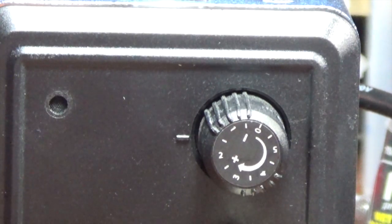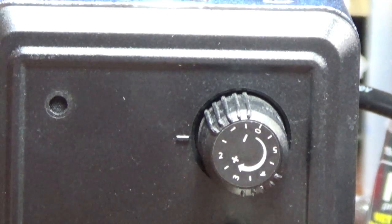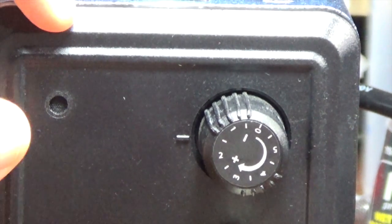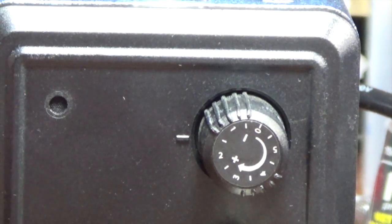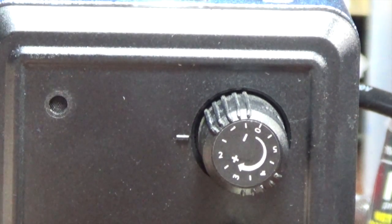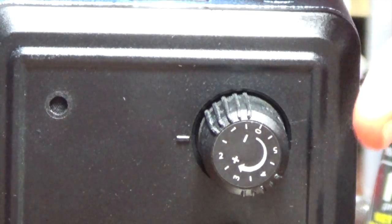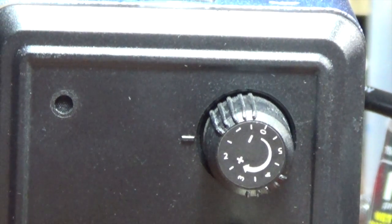Maybe it's because of what I'm used to. Maybe this is a better way of doing it, but my personal preference is I would prefer a dial showing 0 through to 28, or more properly, probably 0 through to 40, with the actual gauge being able to get up to 28, and that way you would know if it went above pressure by accident if something was going wrong. But it's a small quirk, it's something that's livable with from using it.